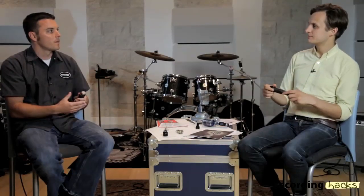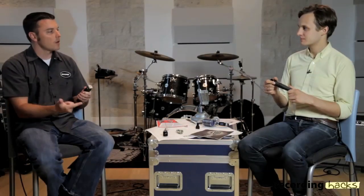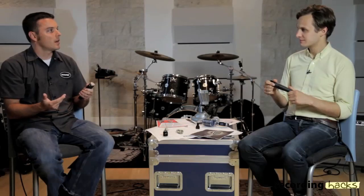Absolutely. Okay. It's all about chasing resonance frequencies in a dynamic microphone, and it's all about tuning different air volumes and cavities of air to get the response we desire. Because naturally, a dynamic microphone and the Mylar inside of a gap around a magnet doesn't create something that is good sounding, right? We have to do a lot of manipulation to materials, volumes, processes, everything to tune the microphone to get the response that we desire. Okay, great. Well, let's move on to problem number two.